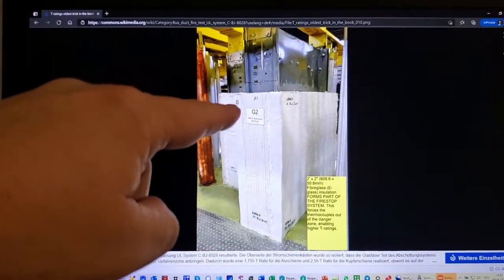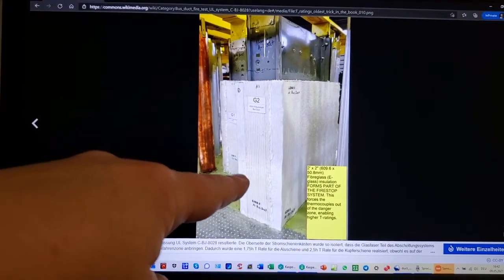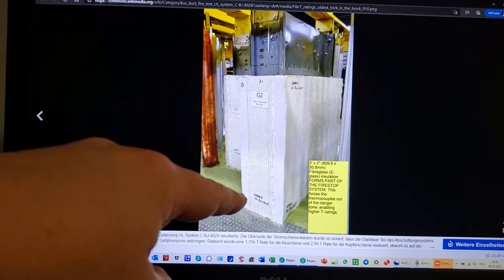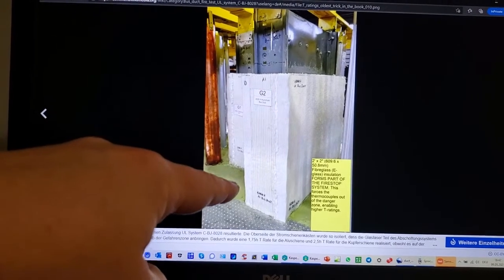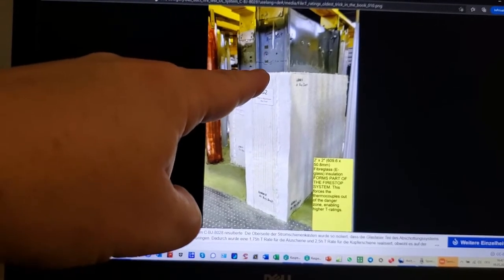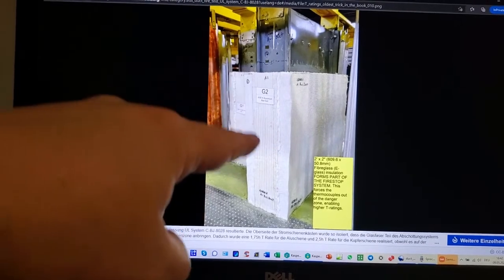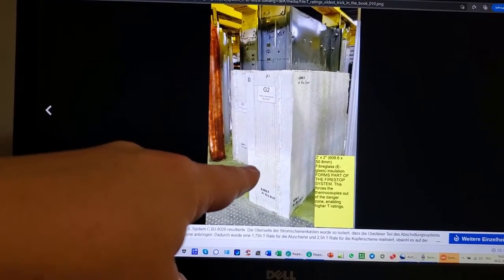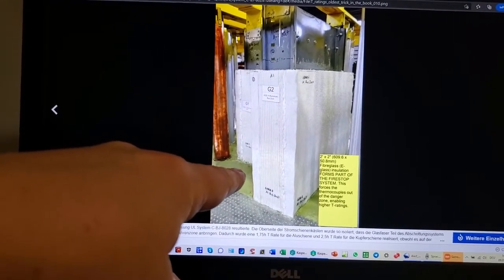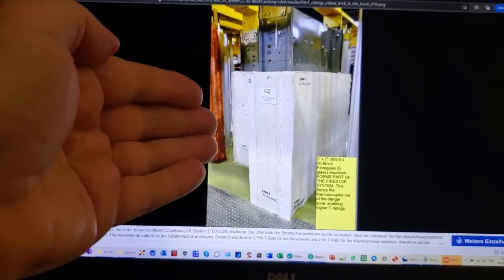So by making the fire stop part of the fire stop system, we put in fire stopping, we put thermocouples 1 inch up on the penetrant itself, and on the fire stop 1 inch away from the penetrant. So by putting this insulation here, I'm forcing the thermocouple from 1 inch up down here to 1 inch up over here. And instead of 1 inch over from the bus duct itself, which is burning on the inside, I'm moving it 1 inch away from here.